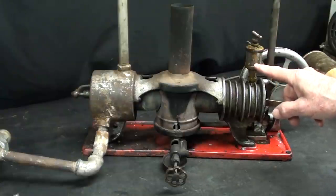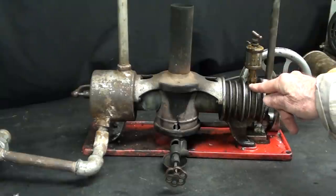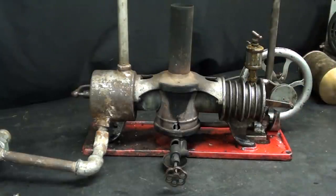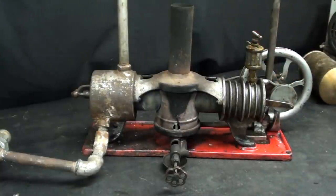The oiler is definitely added by Bubba. The reason I say that is it leaks like crazy. The wall thickness of this cylinder is not thick enough to accommodate a pipe thread, even though it's only 1/8 inch — that's why there's a leak there. I need to plug that permanently. We believe collectively that somebody put this in because the engine ran so poorly they wanted to lubricate it. In fact they over-lubricated, which causes problems — if it gets too hot the oil gets sticky. I use graphite in those other little engines.